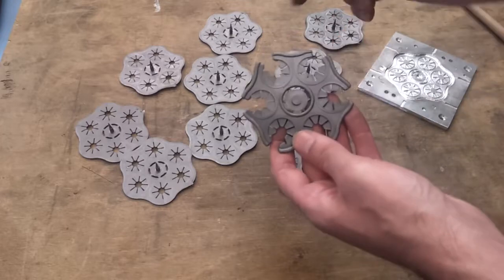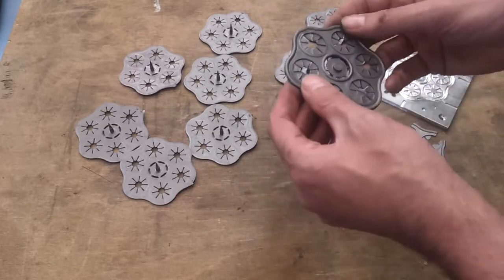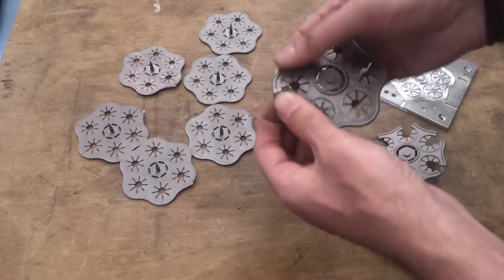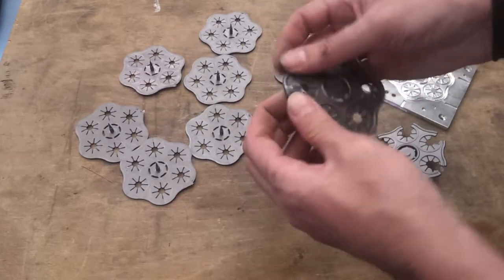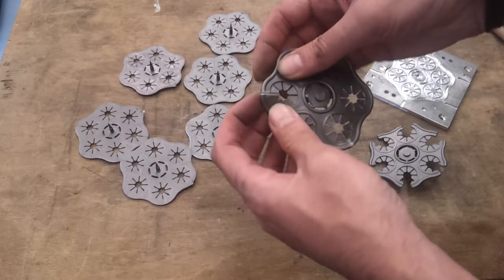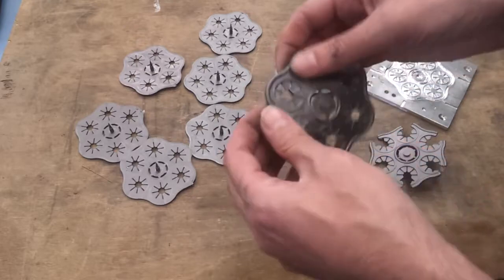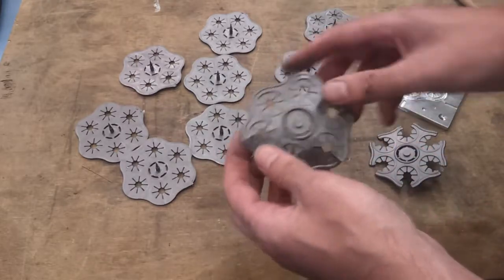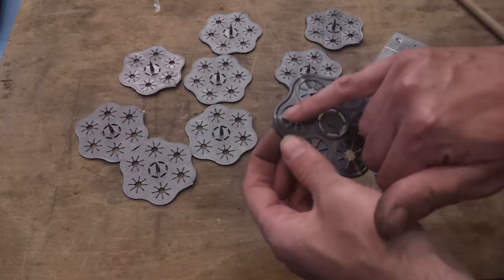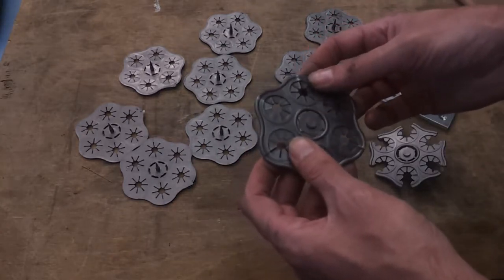Clearly, the way this is flowing, I'm going to get weld lines directly opposite, and that could be a bit of an issue, because theoretically there's going to be a weld line there, and if that's flexed enough, that could break. But with this being a fairly heavily plasticized polyolefin, it's got a lot of, there we go, that one's snapping through, it's got a lot of synthetic rubber in it, so it should have reasonable resistance, but it is cracking along there, and also this has probably still got some polyurethane coming through, which isn't going to help. So maybe I need to just do something to get that weld line moved. Not entirely sure what. I'll have to have a think about that.